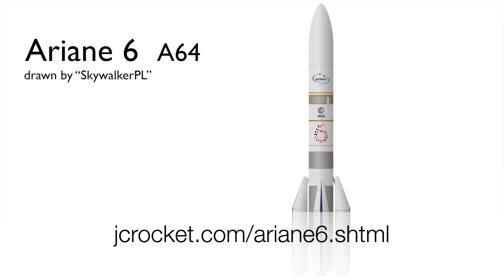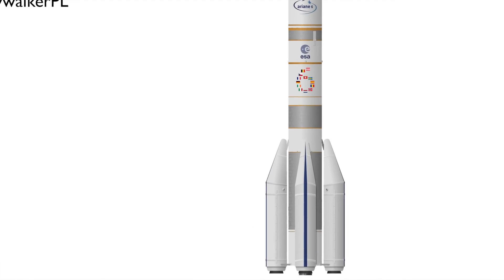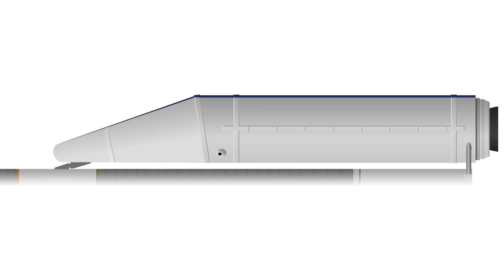In late 2018, I got interested in building an Ariane 6 model. This is particularly interesting because of the drop-away boosters. While I'd looked into drop-away boosters in the past, I never actually built a model that used them. When I'd considered drop-away boosters before, I usually thought of explosive bolts or something else that's impractical at small scale. So what started me working on this project was thinking about how the drop-away boosters could work, because of the way they're attached in the prototype — it leads to a natural idea for a similar attachment in the model.